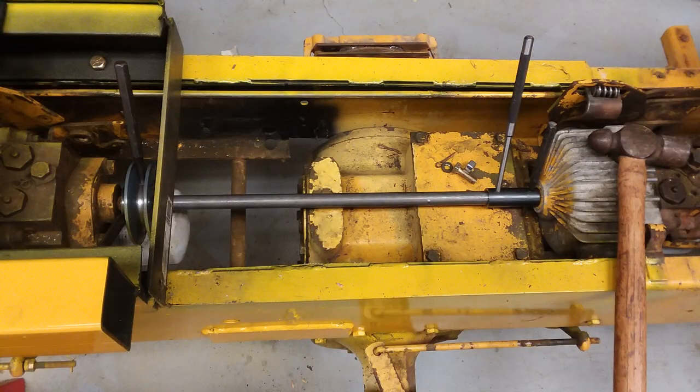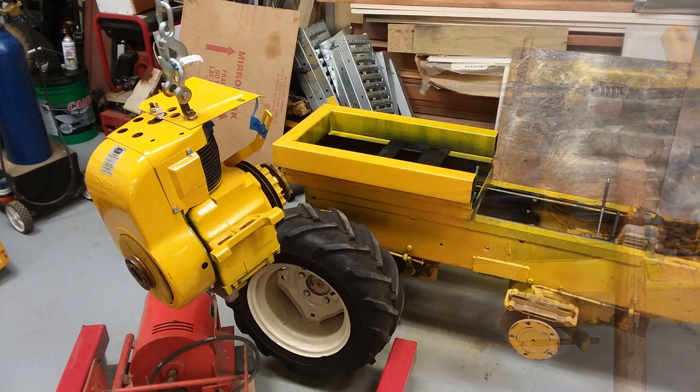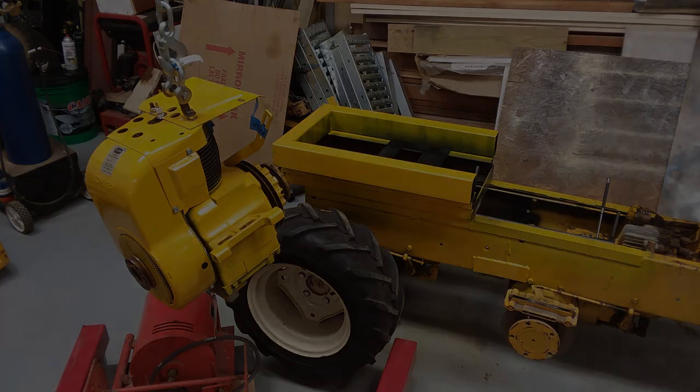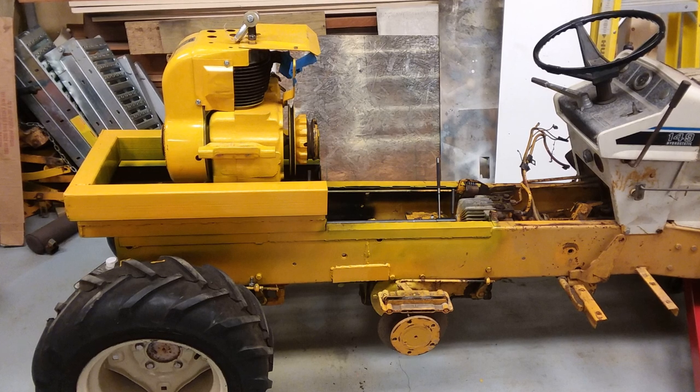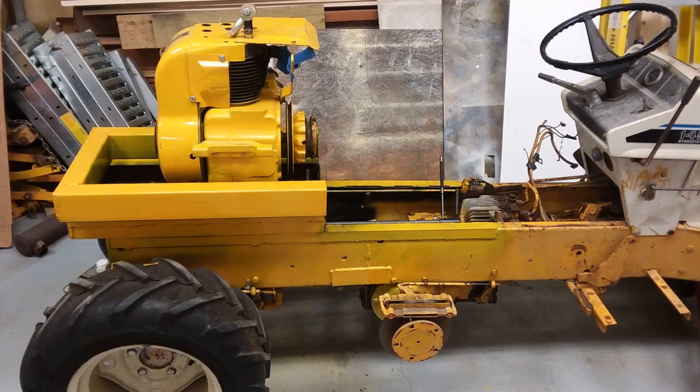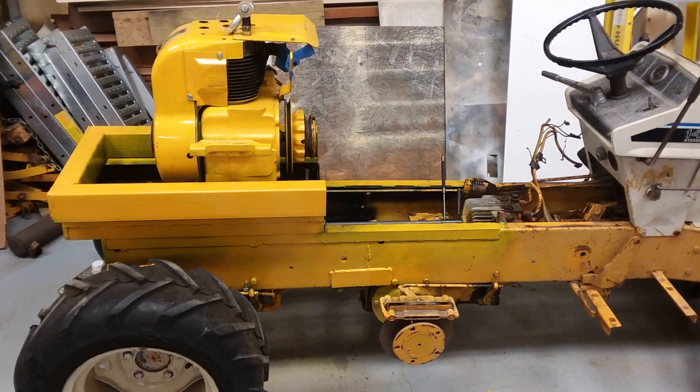I tried to keep some paint on the metal as I was working, so you'll see yellow paint on many of the parts as they're added to the frame. The drive shaft between the two hydros is fitted. The engine is a 12 horsepower engine out of another Cub Cadet that I had rebuilt and was sitting on the shelf — I didn't use either of the engines out of the two donor tractors. You can see it sitting in the frame and I'm looking at the alignment of the engine to the pulley down below, making sure I had it in the right position.